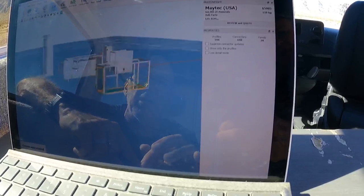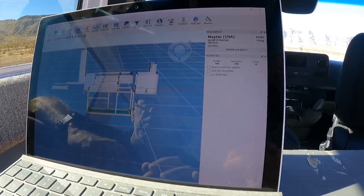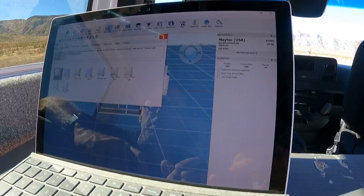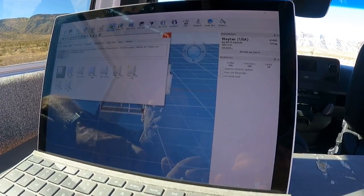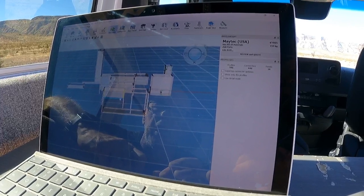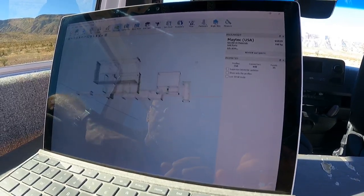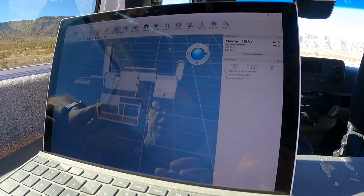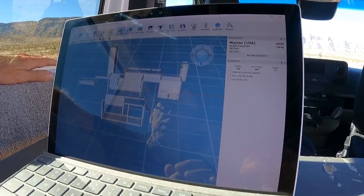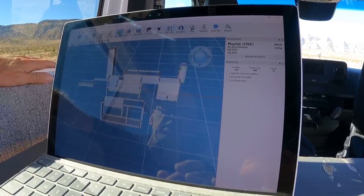At this point you can put the door and you can put panels. If you click a panel, it puts a panel in that location — you can see it's kind of shaded, meaning there's a panel in there. It'll give you the cuts exactly on how to make that panel. The panels can either be slot paneled, so they go within the 80/20 slots, or contour so they go over the top, or a rectangle panel. There are other options like end caps and corners.